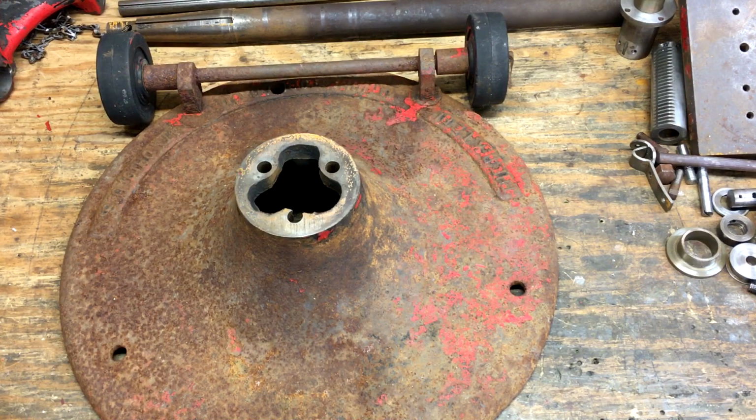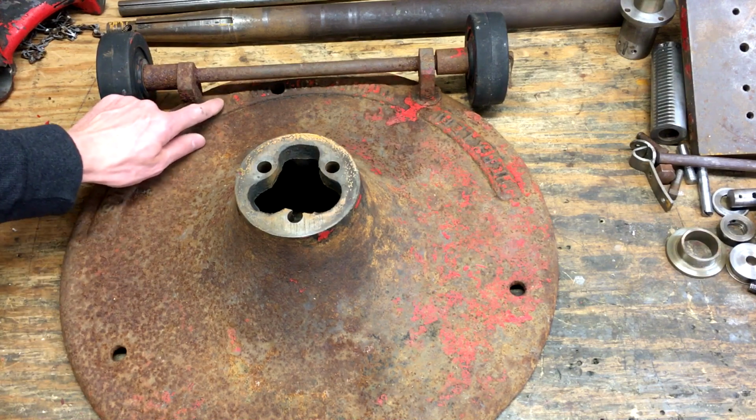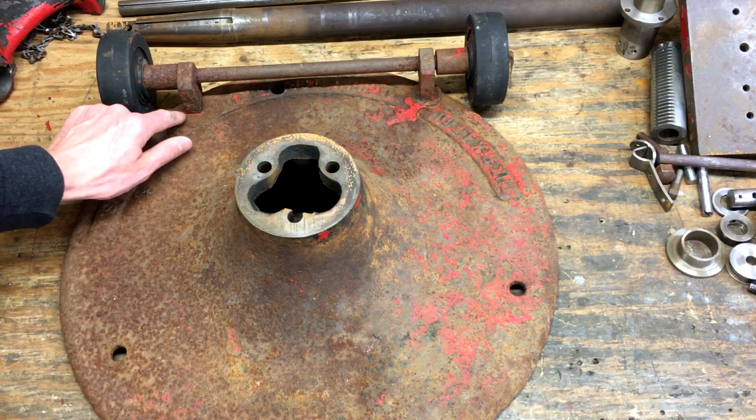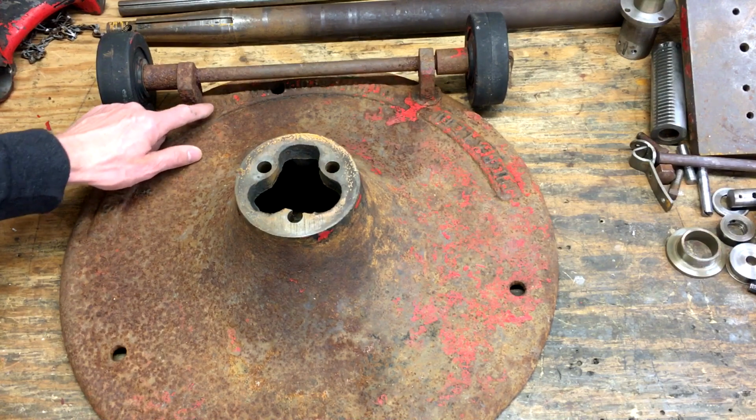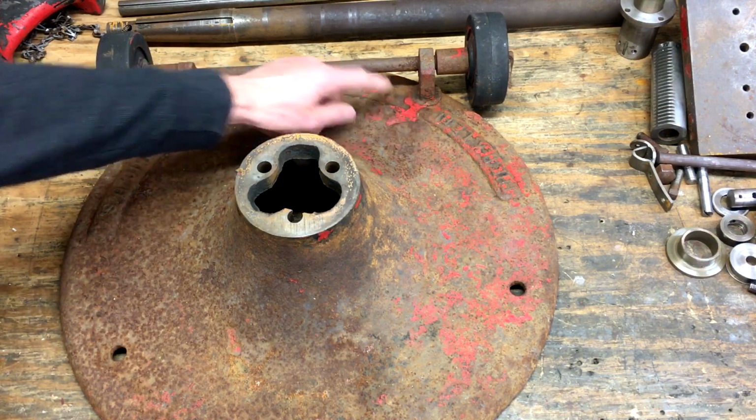I could try to build it up by brazing. That's probably the most durable way to fix it. But I'm a little concerned because I've never done that large of an area, and I'm concerned about cracking. I know I could build it up with just body filler, but I feel like that would chip off pretty easily. I want to be able to build up the area past the letters and then use a die grinder or files or whatnot to re-carve the letters into these 2 areas.